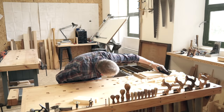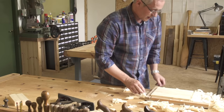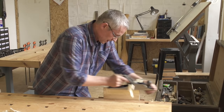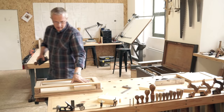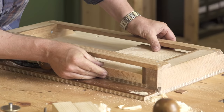You can check for flatness as you work with the corner of your plane. Take the timber out of the planing board and secure it in the vise. Plane the face edge, check with a square and adjust as necessary. Then place the timber in the shooting board with the face side down and the face edge against the stop, and shoot one end square.